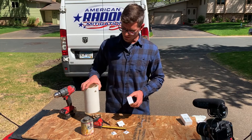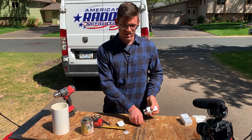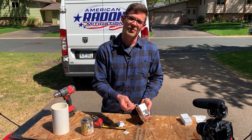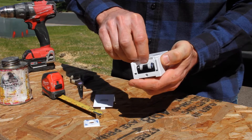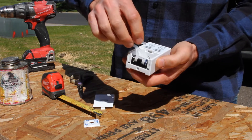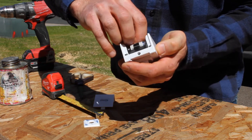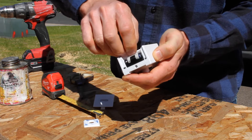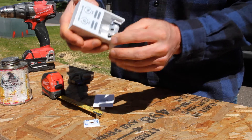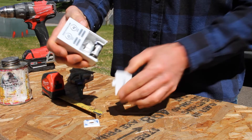So you don't have to mount it directly to the pipe. But the problem with this alarm is if you install it the way the directions say — putting the provided tubing on the barb on the mounting plate and on the barb inside for the alarm — when you put it inside you get kinks. If that hose is kinked, it is not going to work.